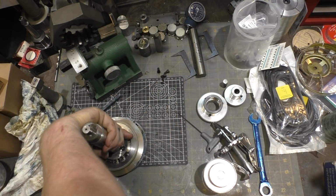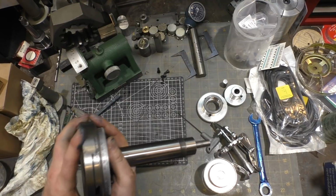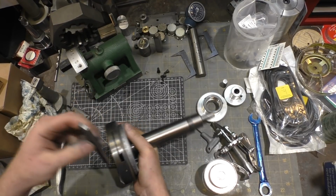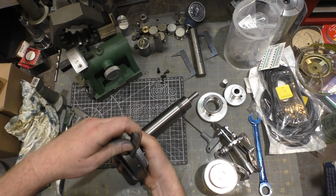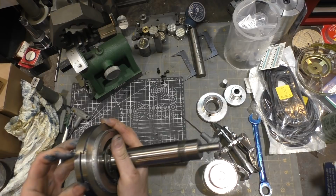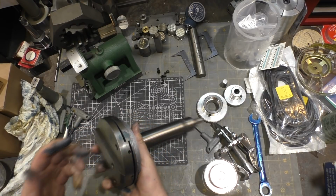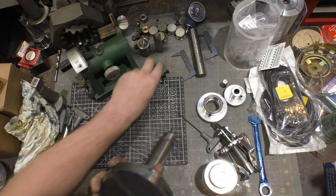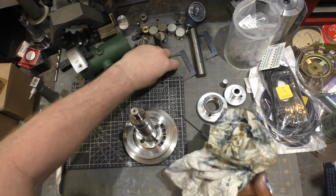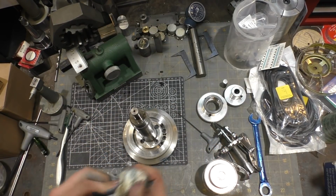So it will go like this. Okay, so I'll pop that dovetail over in the corner. Then I will slide the gibs in. A gib, singular. There we go. It's still spring loaded, so now I need to get these guys started. These three screws started over here, which I have not completely cleaned yet.